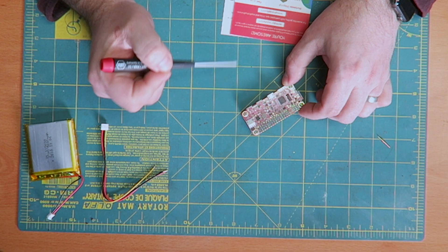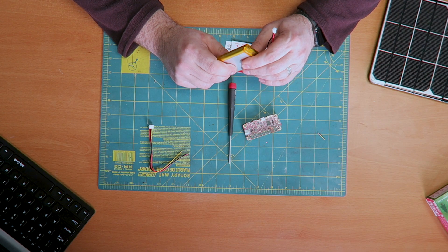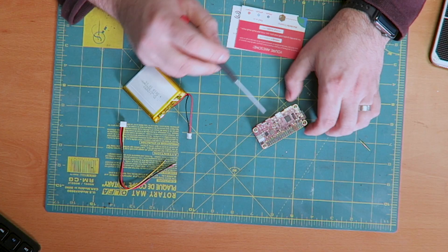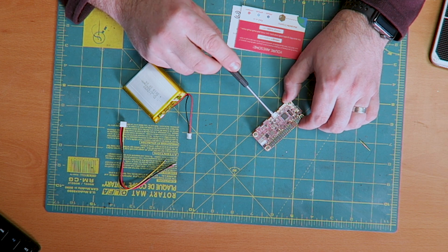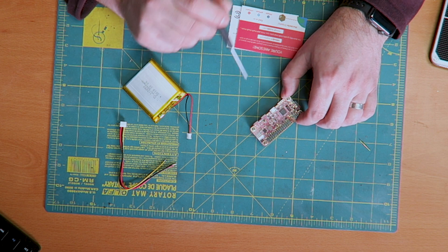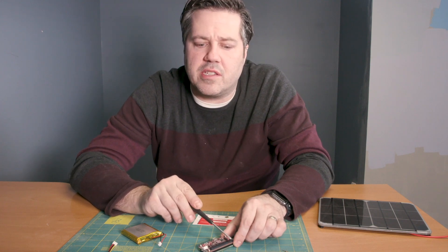This connector over here is for the battery. For my project, I'm using a 5,000 milliamp battery. You can pretty much use any size battery. On the Pi Juice site, they give a couple of recommendations and actually sell batteries that work with this. 5,000 milliamps seems to be a good in-between as far as size, weight, and how long it could power the system. The only other port for power input on this is this second USB mini port, and this is going to be the one where the solar panel will connect. If I was just using this as a battery backup, I could plug mains power into here, but in this case, this will be the connector for the solar panel.